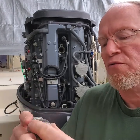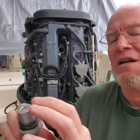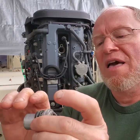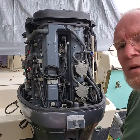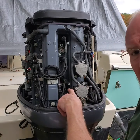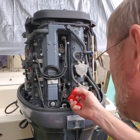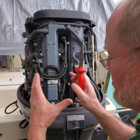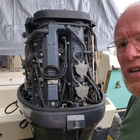I got it all back on there. I'm going to put this rubber grommet back on. One thing I always do is put some grease on the outside of this grommet and that aids it to slide into the block of the powerhead. Then you're all set just to tighten that bolt up. When you're putting these back in, you can put the rubber ring inside if you wish, or you can leave it on the outside and grease it up. Either way works, just slip them in there. The rubber grommet gets crushed out by the anode when you bolt it up. So once it's centered in there, just put the bolts in and tighten them up.